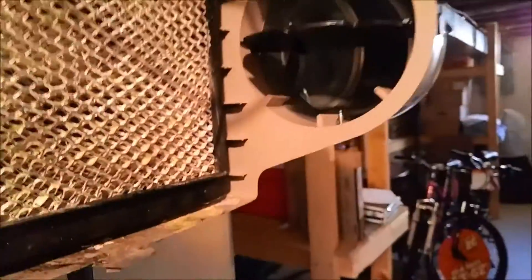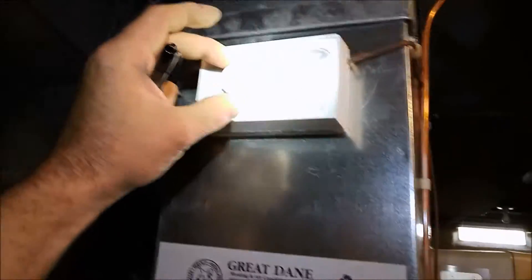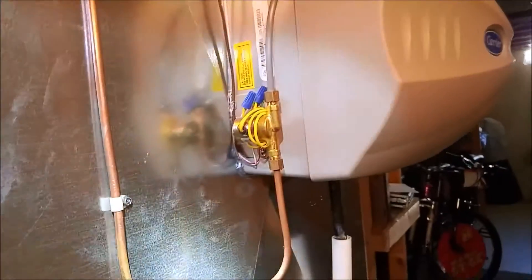Make sure the damper is open. Get the case back on. It's only like 25% humidity in here — should be a lot more. So I'm going to set it to 35, because if I can't saturate that whole pad, it just won't humidify at all.